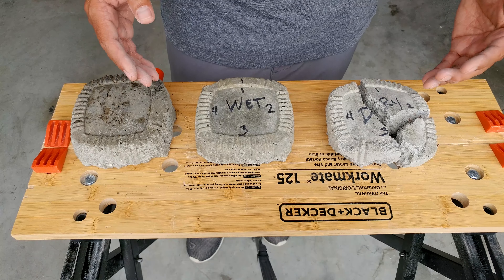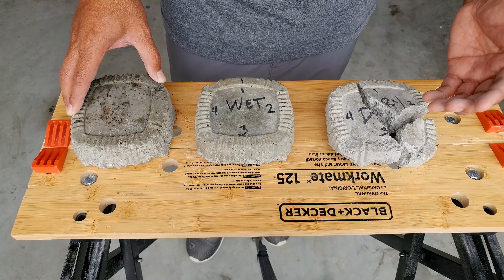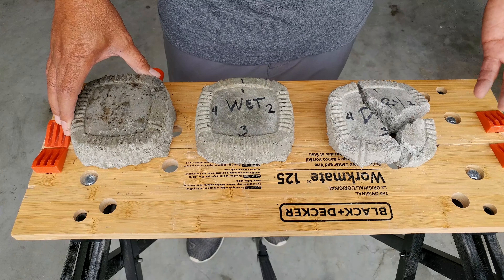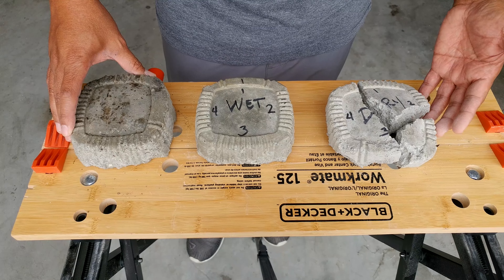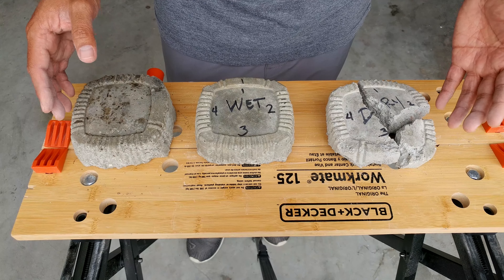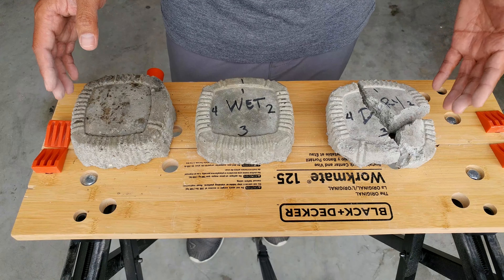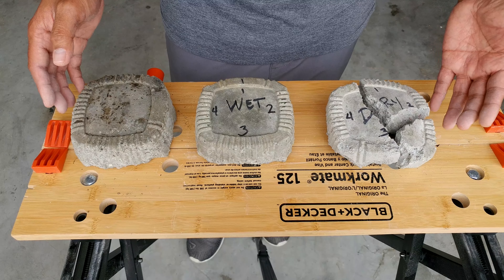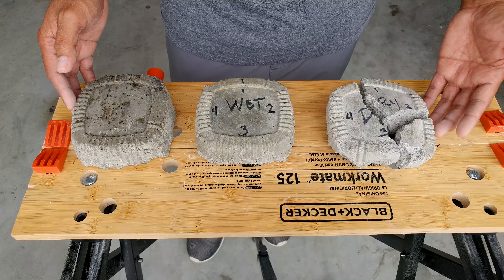I would say that if you're okay with 70% of concrete strength, then feel free to use the dry pour method. When I received the quote for the driveway, the spec they listed is only 3000 PSI — so this will work for a driveway, especially if you're only going to park a small passenger vehicle. But if you have a choice, I would go with the manufacturer's recommended method. You already spent time preparing the base and putting the forms, so why not spend a little more time to get stronger concrete? I understand the wet pour method is a little intimidating because once you wet the concrete, you have limited time to finish. If you're doing it alone, it looks impossible — so try dividing your project into smaller sections. But if you have no other choice, use the dry pour method. A dry pour walkway is better than a muddy walkway.